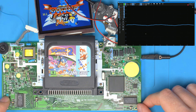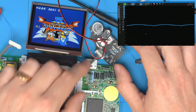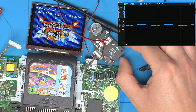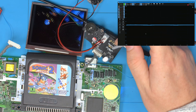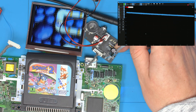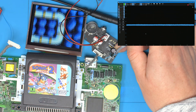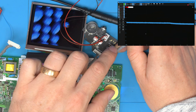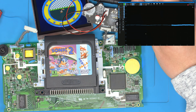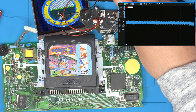The audio from the Game Gear comes through an inductor to filter noise from the rest of the system all the way to the speaker. Let me just put on a much larger cap for now — I've only got cheap ones here. Now we've got a giant cap on the 5-volt rail after the inductor. Looking at the 5-volt rail again, you can see with the giant cap on we stay just below that trigger point. The larger cap almost solves the problem.